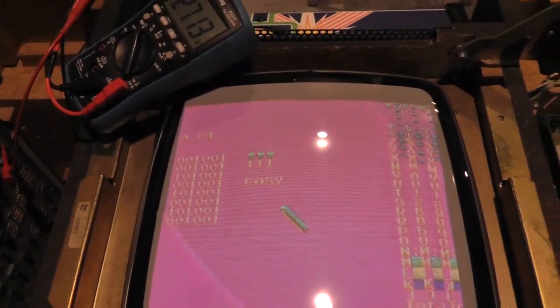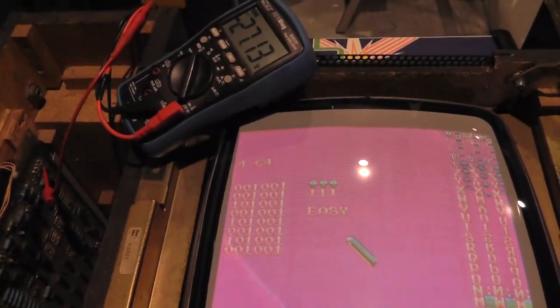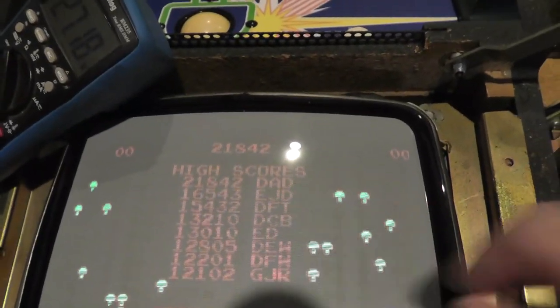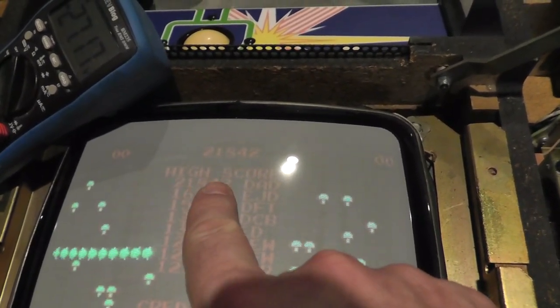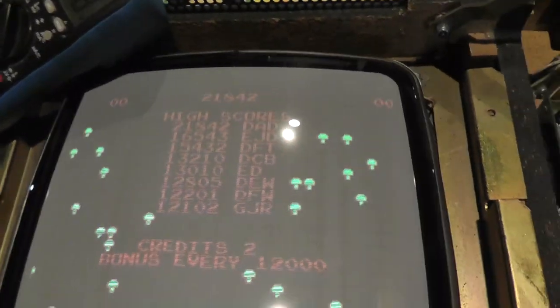Maybe, oh gosh, you know what? Maybe the EAROM is bad. Let me look at that. All right, I don't know why, but it did save the high scores. I power off. I just set a high score. I didn't film it, obviously. Power it on. And it does say, put in my dad's high score, 21,000.